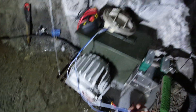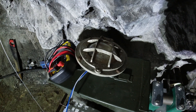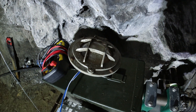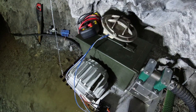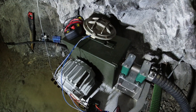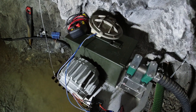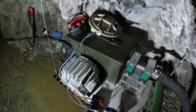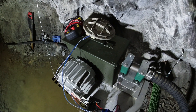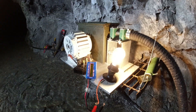The RPM is pretty good. You can see visually what's happening when I connect up the power with that light — you get a sudden surge of light as the turbine has a lot of momentum in it, but it quickly runs out, and the turbine jet itself isn't providing enough thrust to keep the wheel turning at high speed. So I think it's going to be about getting a smaller nozzle with a more powerful jet.